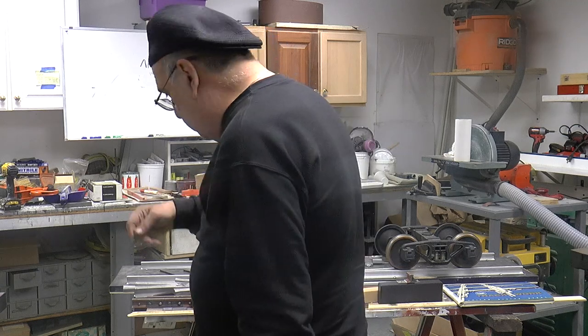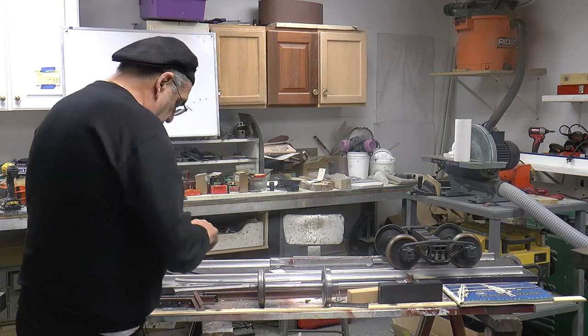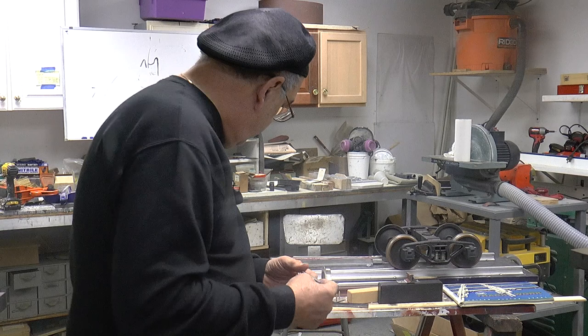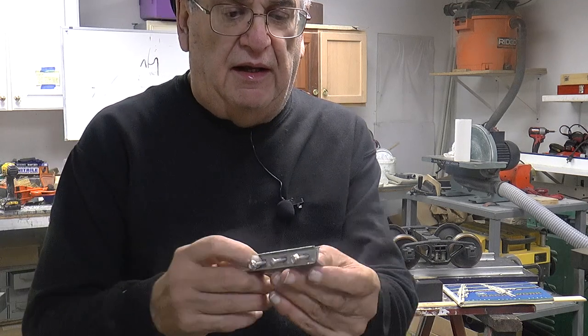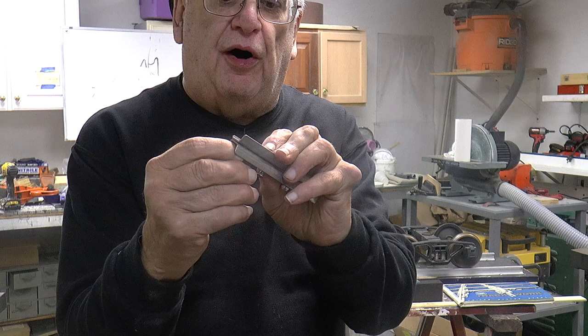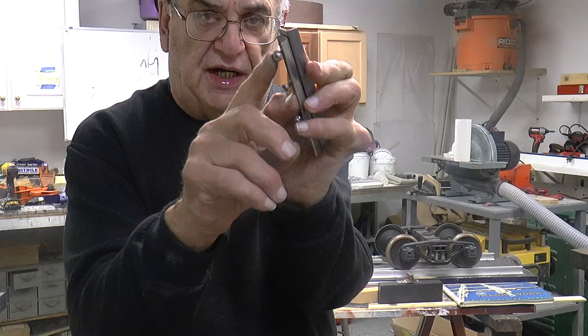You just put it in. I found these little carriage bolts from McMaster-Carr, and they work great. They look scale, and they use a nylock on this side, so when you tighten it up, you back it off a half a turn, and that's enough for the slide.